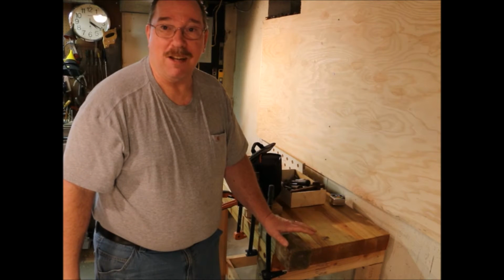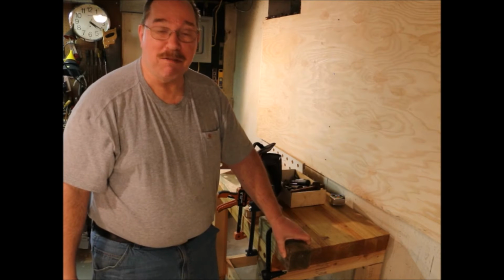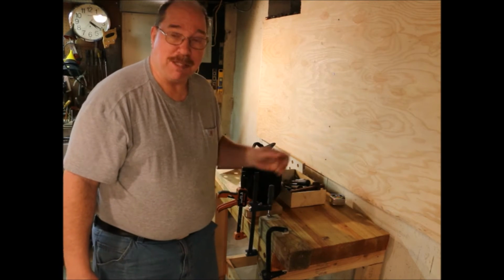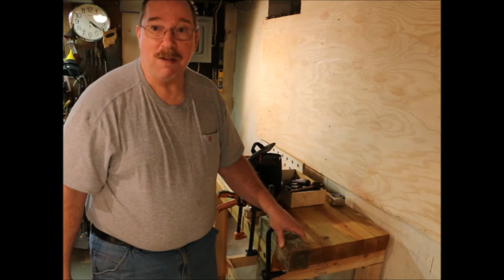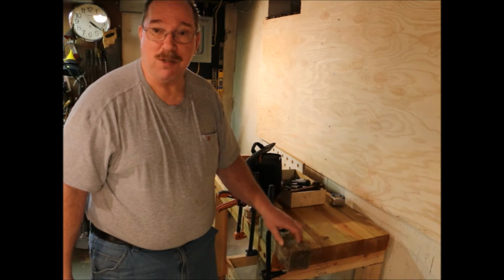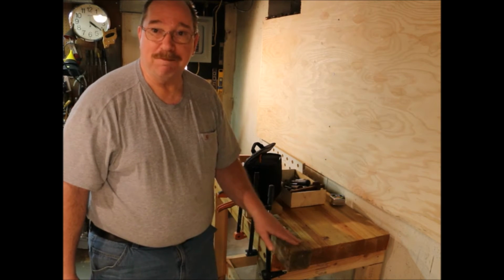It's kind of interesting that in making the vise, a really handy thing to have would be a vise. But I'm gonna get by with these clamps. I just gotta cut off a chunk of this 4x4. I wanna use the 4x4 because it's gonna raise the draw knife up so that the handles don't hit while I'm doing the polishing on the blade.